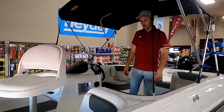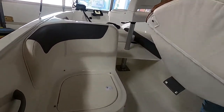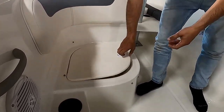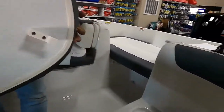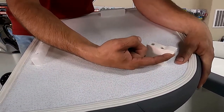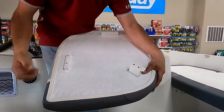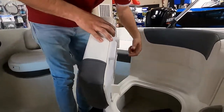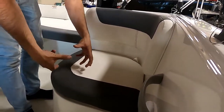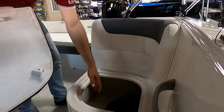Moving to the midsection of the boat, you've got two removable seats in the cockpit — these just snap in. These seats cover the live well, which has a built-in live well here, and this is also some additional storage. One thing I do want to mention: if you take a look at this seat, you see this bracket with a little hook on it — that hooks under the fiberglass. When putting the seat back in and especially when pulling it out, be very careful that you don't just rip up on it because you can chip the fiberglass easily. What I like to do is put the hook edge in first when locking it in place. When removing the seat, don't just pull up — start from the back where they've got a ring for you to pull up on. That allows the hook to come out without chipping the gel coat.